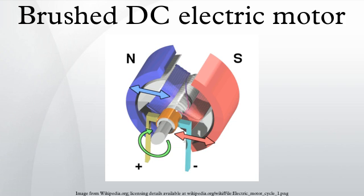In a separately excited motor, the field coils are supplied from an independent source, such as a motor generator, and the field current is unaffected by changes in the armature current. This system was sometimes used in DC traction motors to facilitate control of wheel slip.